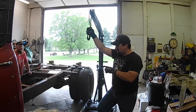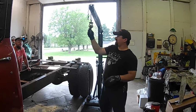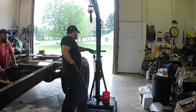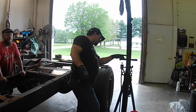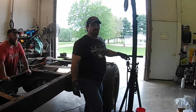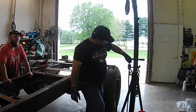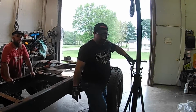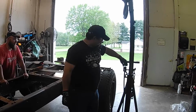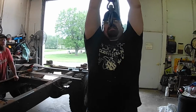Engine hoist to hold up the back side of the truck. And this is a great engine hoist we have here. It's pretty stout. It can actually pick up a lot of weight. Dad says he thinks it's more than capable. Matter of fact, it says right here it's got 2,000 pound capacity on the tag. So it's a big one. The only problem is, as you can see, I'm loosening up the valve and it doesn't drop on its own. Dad put dual packings in this years ago, I believe, and it stays pretty sealed up. The downside is it needs help coming down.